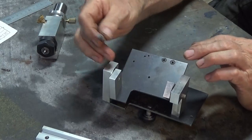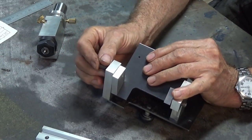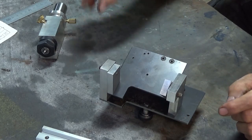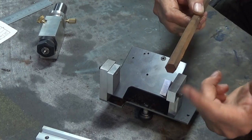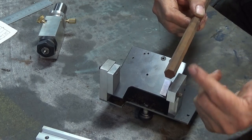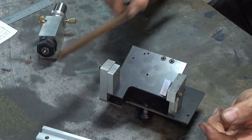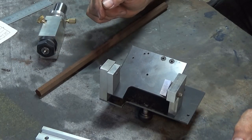So these screws that I made were just temporary for the mock-up, and you can see how it's going to work. That's going to pivot like that. So I'm going to make those out of this hex mild steel stock. And yes, it's rusty, and that's how all mild steel goes in my workshop, but these will get zinc plated later on. So let's go and do those now, and we'll also make the spacers for the V-slot track.